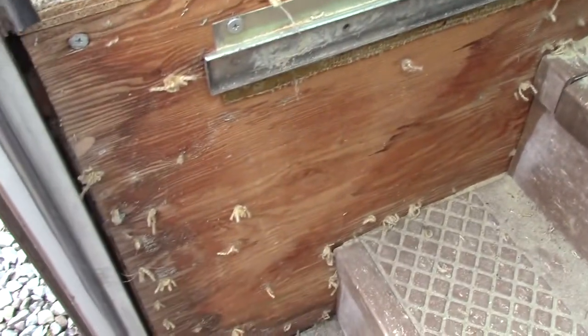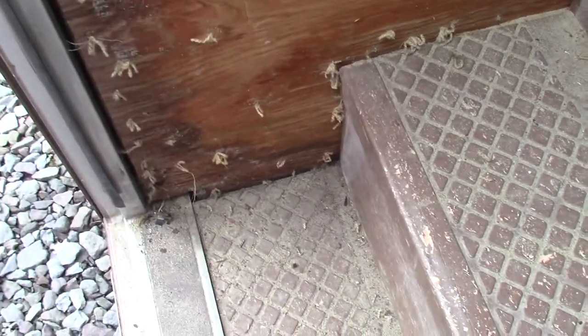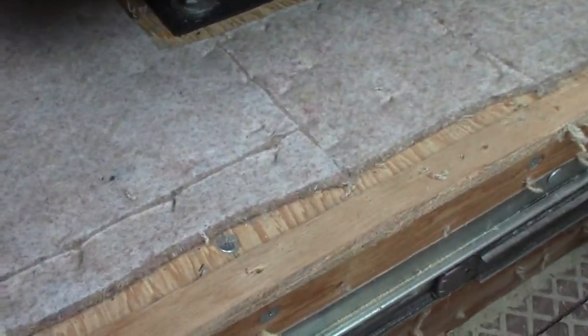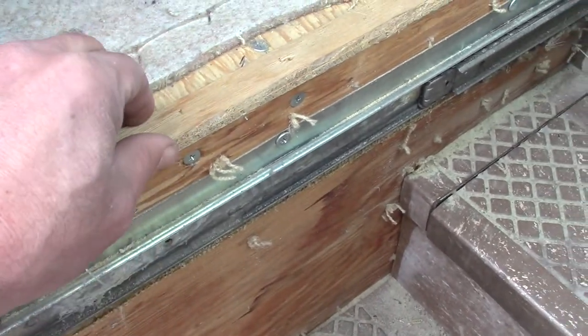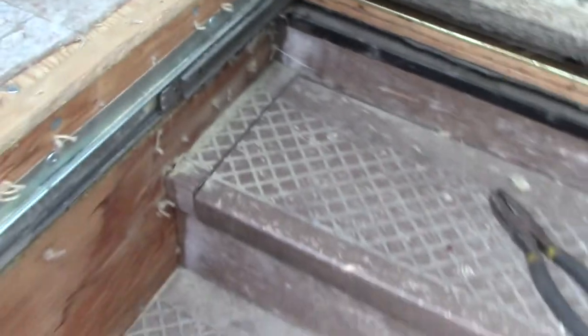I tore out this piece of carpet — it's stapled everywhere with little carpet staples, not real heavy. So I think I'm going to wind up using T-50 staples because that's what I've got. I do have an air stapler. There's a lot of dirt and sand — I'm going to clean that all up. They had a little pad here and then it's just stapled down without tackless strip. I noticed they don't roll and tuck it. If I'd done a spot like this I'd just roll the carpet under about an inch and staple it down. So it's going to be kind of a quick facelift — I'm just going to throw down new carpet and leave the old pad, unless it stinks or it's really rotten. What I've seen of it so far it's pretty decent. Probably give it a quick vacuuming and call that old pad good.